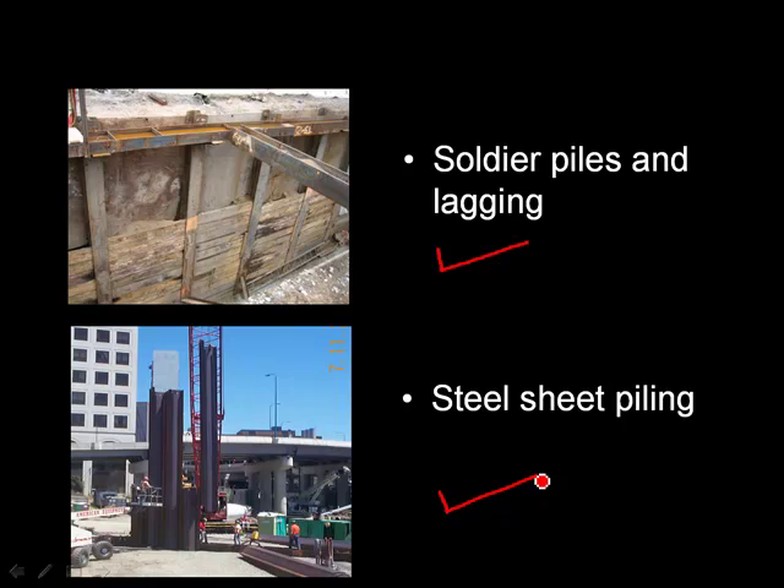When you're operating below the water table, you need to continuously dewater the excavation to keep it dry, and now you need to use steel sheet piling. The steel sheets are interlocked to keep the water out, and as you can see in this photo, they are driven in a sort of progressive way — not driven all at once.